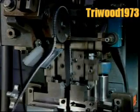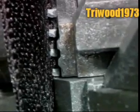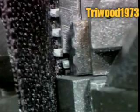To make metal zippers, the factory feeds a long continuous roll of tape onto what's called the teeth machine, along with a roll of metal ribbon known as flat wire. As we see here in slow motion, the machine cuts off a tiny piece of flat wire, forces it through a die that forms it into a tooth shape, then clamps it onto the edge of one side of the tape. The machine does all this at a rate of 45 teeth per second.